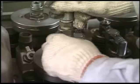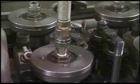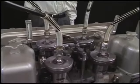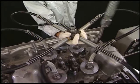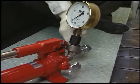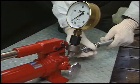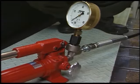Tighten up the tightening screw of the hydraulic hose firmly. Next, connect the hydraulic pump with hydraulic hose, operate the air valve of hydraulic pump, and open the relief valve.